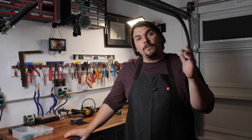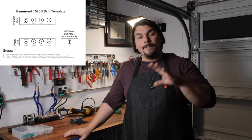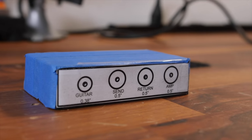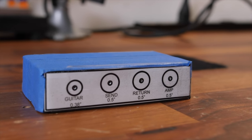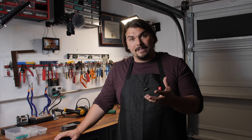The next step is you're going to follow the links in the description and print out my drilling template. This is going to allow you to tape a template onto the box I've designated today, which is the Hammond 1590 enclosure. It's going to show you exactly where to drill, the size of the drill bits that you're going to need, and then we'll be able to start the assembly. I'm going to print that out, tape the template onto the metal box itself, drill it out, and then we can start our assembly.